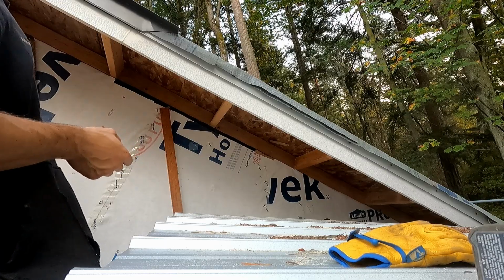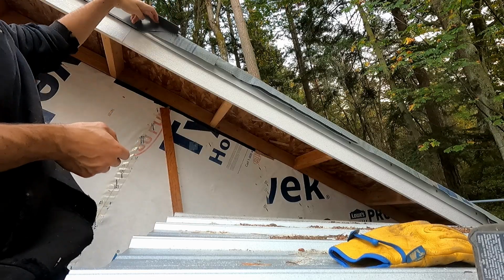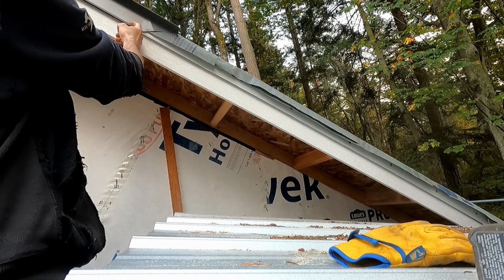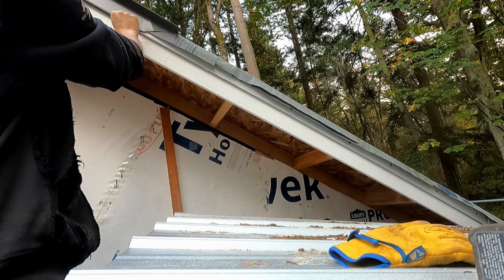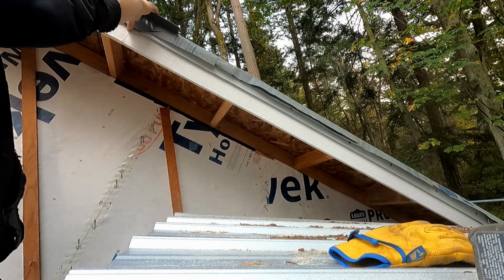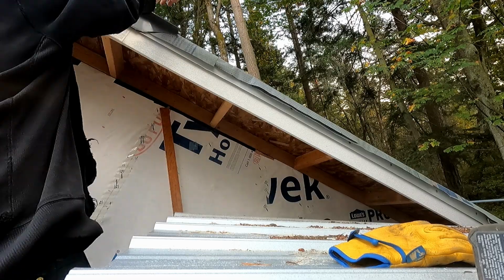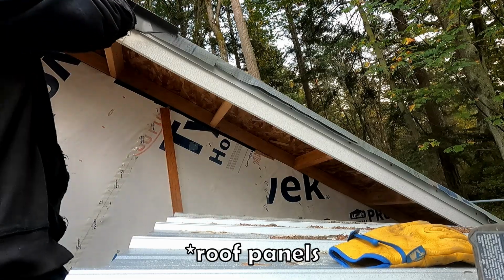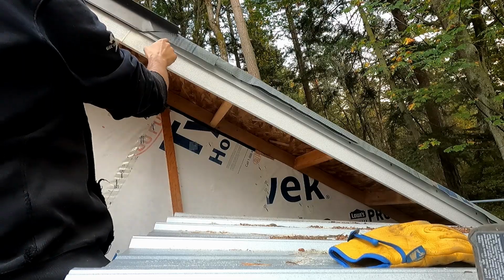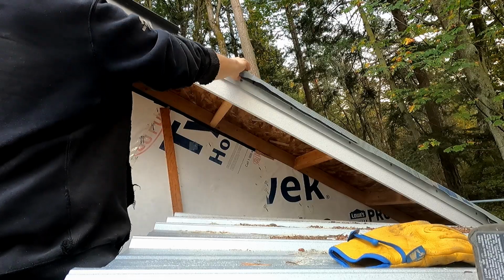We don't want that. And so this profile lays flat on top of the roof, overhangs, goes back, runs down the rake, then comes out just like this cleat does, and then wraps around in a 180 degree hem and goes back up. And so the idea is when you're installing this, peel this out and hook it on that cleat and then screw it in the top. And then the roof deck covers the top fasteners. And so this edge is supported by the screws that are holding the cleat. The cleat is screwed to the rake.